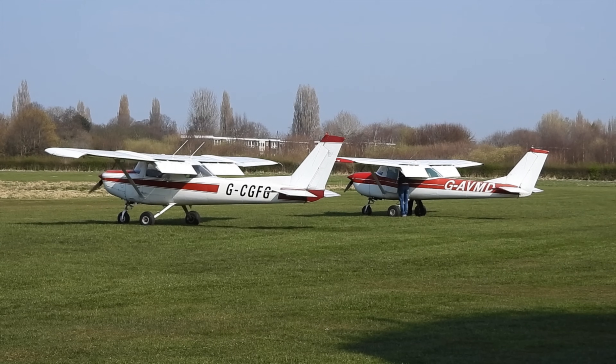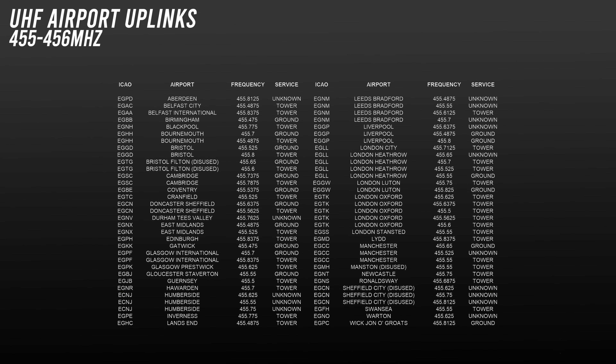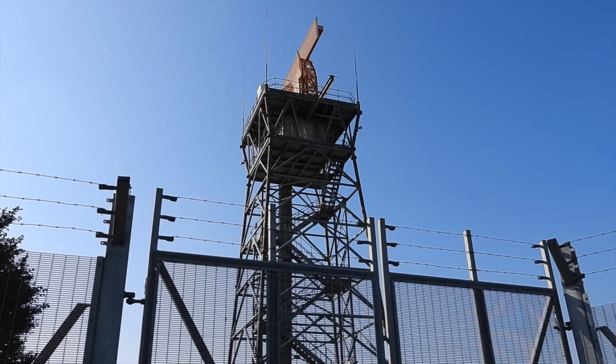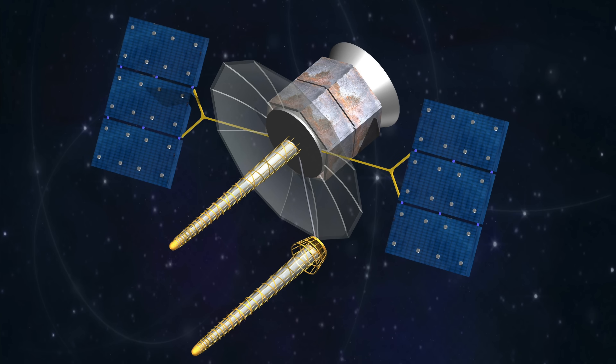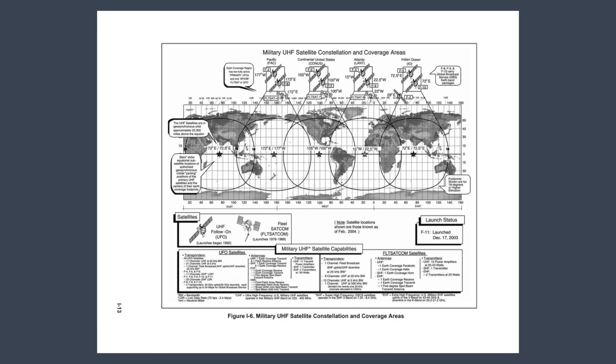So instead, here is a list of all known UHF uplinks for UK airports. These frequencies are all in the UHF band and are FM. They're used for ground vehicles at airports that don't have airband radios to monitor the movements of aircraft. These are live uplinks of the control towers and are usually easier to receive further away from airports when compared with AM air traffic control transmissions. Next we'll look at SATCOM pirates — these are a handful of the most active frequencies for what are known as fleet SATCOM geosynchronous satellites. You need to look between 250 and 270 MHz. These now-disused US military satellites started being used by Brazilian loggers to enhance their radio range. Truck drivers in remote regions beyond the reach of traditional radio range use them to keep in touch with friends and colleagues. Drug dealers, organised crime factions and ordinary citizens alike have all been heard using these satellites and they're well worth monitoring.